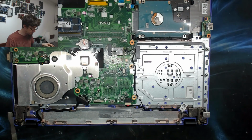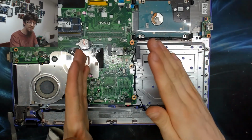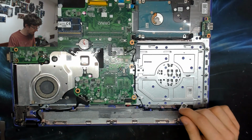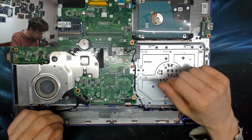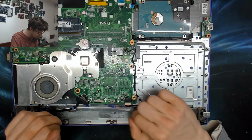I'm impressed that the power supply stayed on. The power supply is getting dragged down to 0, and then it is bouncing up and down as it tries to cope with the dead short load. So yeah, that's what's going on with that little oscillation we had there. Fine, okay, right. Time to get the board out then, because we've got to start probing around these areas.